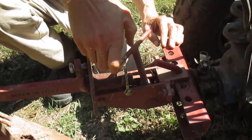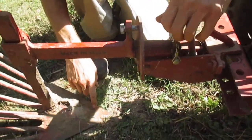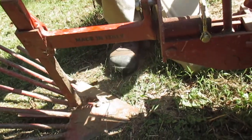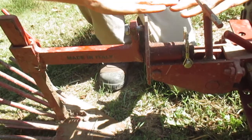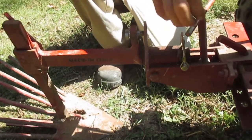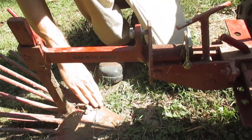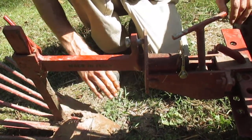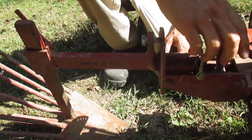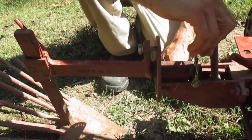When I crank this thing up or down, if you watch the tip of this down here, it's actually changing the angle — cranking this whole arm up or down — so it's changing the attack angle of this point. That's critical, because if that attack angle isn't right, you'll never get the thing down into the ground, or it'll never stay in the ground, or if it's too aggressive it'll go down too quickly and try to dive and you'll have a terrible time.